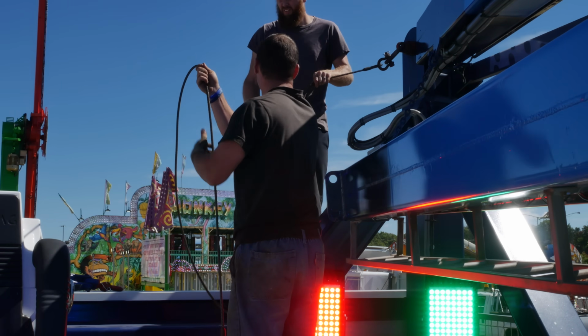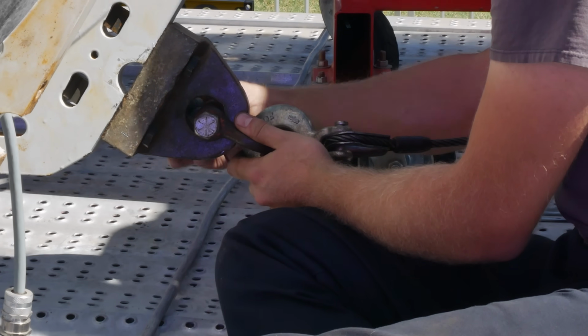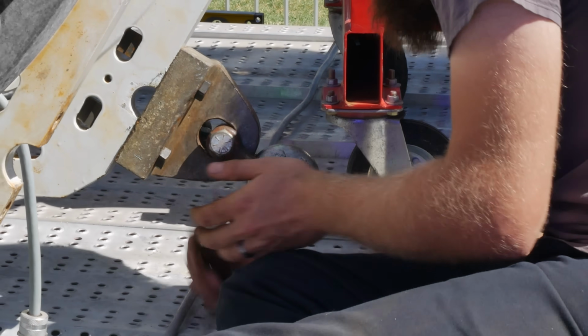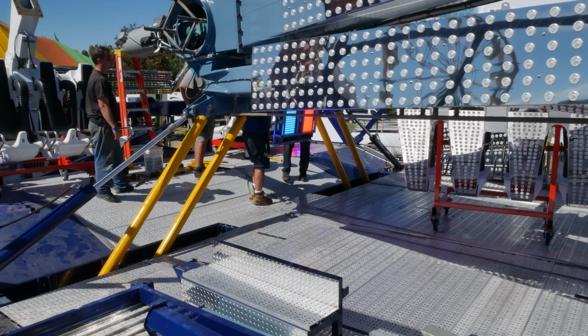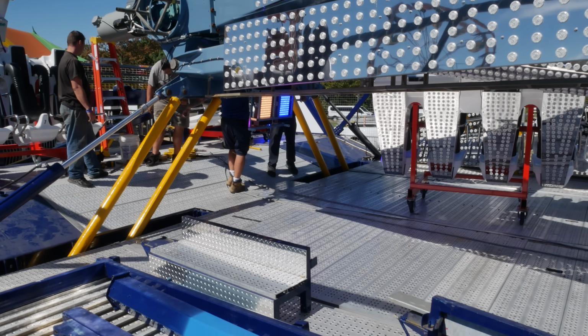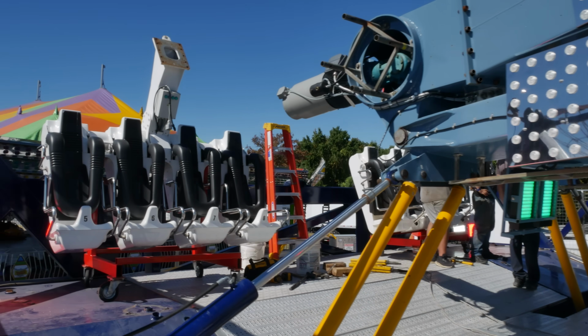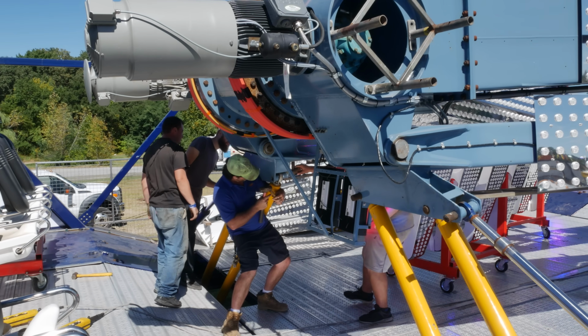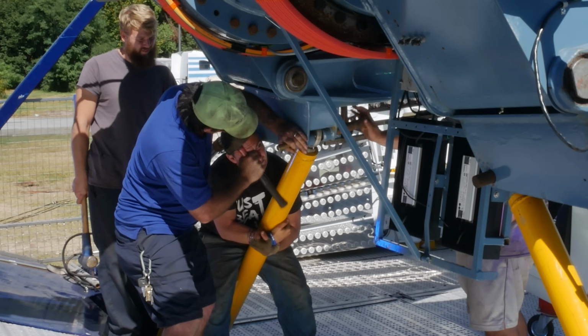Prior to lifting the tower, the swing arm is supported by steel cables to prevent it from, well, swinging. These yellow struts create a 4-bar parallel linkage that allow the tower legs to pivot towards the center. Now that the two halves are joined, the struts and the hydraulic cylinders can all be removed in preparation for lifting the tower.